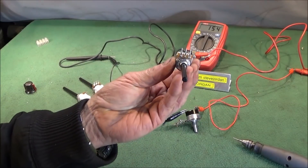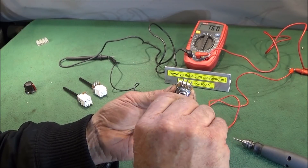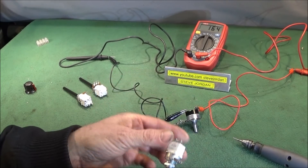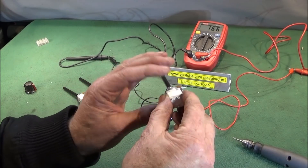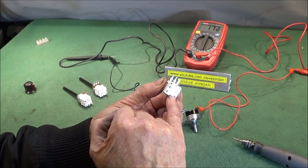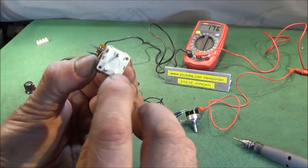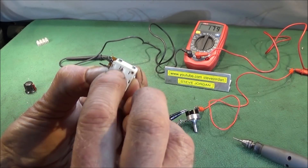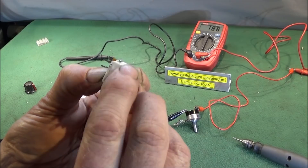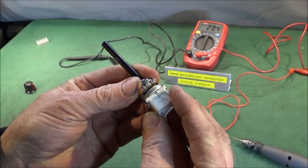The only drawback with the Maplins potentiometer is that these are set in normal rotation, where you turn the potentiometer clockwise and the switch contact is bridged at the back - so it's actually opposite to the original one. But that's no problem because you can quickly and easily take these apart and move the contacts to reverse that. If you look on the back of the potentiometer you'll see two extra slots which have been cut in the casing, and all you're doing is moving these two contacts over into those two slots, but you've got to take it apart first.